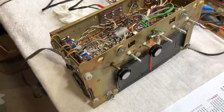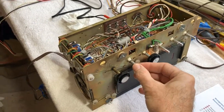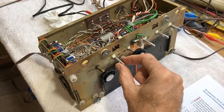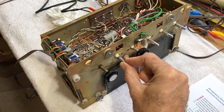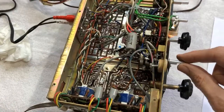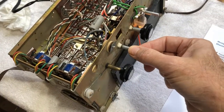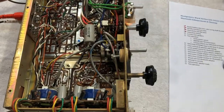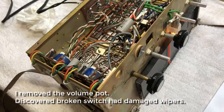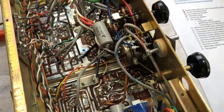We have an interesting problem here. I noticed there was no volume coming out of the left speaker, and I assumed maybe the balance control just needed to be cleaned - that wasn't the problem. Watch this: if you pull on this knob, the audio moves to the other channel, then let go and it comes back on the right channel. So this volume control is messed up, as is the switch. If I try to go to the off position, that happens. I'm tempted to try to remove this assembly and see what I can do.